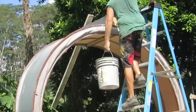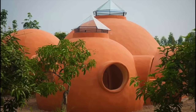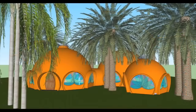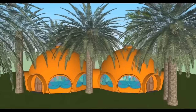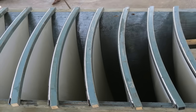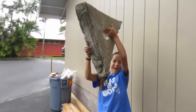Our forms are made of inexpensive and easily accessible materials that can be reused over and over again. You simply pour in the liquid AirCrete and let it harden overnight. The material cost for an arch like the one pictured is about $75. The material for a bare AirCrete dome home like Steve's is less than $2,000, and that includes the foundation and the subfloor. Arches transform the awkward curvature of a dome into flat vertical surfaces that are more practical for windows, doors, closets, furniture, etc. They also make it easy to connect different sizes of domes in countless configurations. Flat rectangular blocks require a lot of extra labor and materials to smooth over, so we developed a way of casting larger AirCrete blocks that already have the curved shape of the dome — which of course saves time and money.